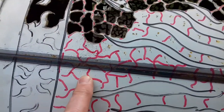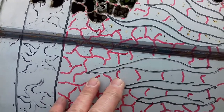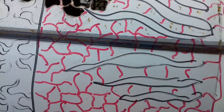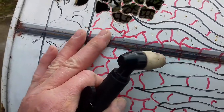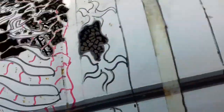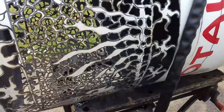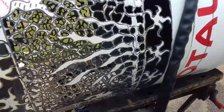What I do is draw my pattern on first. When I'm doing my gas bottles on a dark colour I draw my pattern on with chalk, then you can change it to whatever you want. Once you've got what you want, I go around it with a felt tip — because as I found, with your hand on the job you're rubbing all the chalk off. You spend an hour drawing and then look back and it's all gone. Also bear in mind you've got to draw on what you want to leave, so make sure you leave enough support.